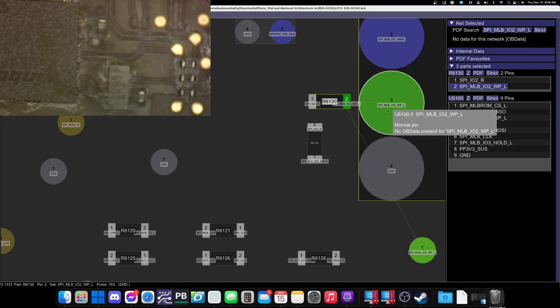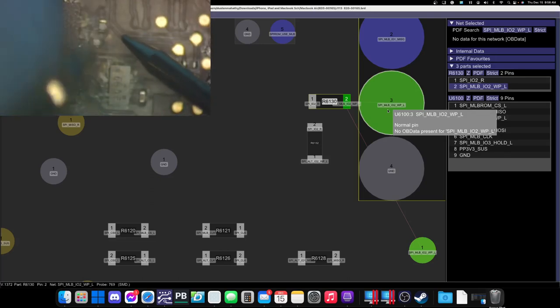Right, and also people would tell you, if they're smart, not to check resistors while they're in circuit, because you could get a bad reading. That's 100% true. You could definitely get a bad reading while checking a resistor while it's in circuit, but it doesn't matter, because 90% of the time it's correct. And even when it's not correct, you can compare it to a known good or another donor and see if you still have that bad reading. So I always check them in circuit, and I don't care what anybody else says.